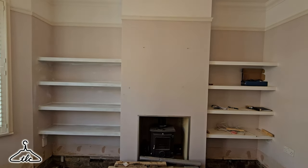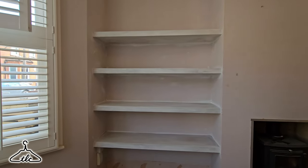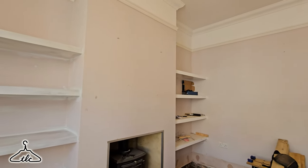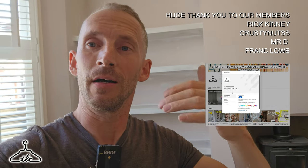There we go guys — all done, we're at about three o'clock. A little bit longer than planned mainly because of the filling, painting and sanding; the woodwork side was pretty quick. This is the finished job: floating shelves to match the right-hand side — 50mm thick, same depth, same heights, lined up with the laser. They're not going anywhere, enough to take books, nice and solid. It doesn't look pretty at the moment but there was no need to cut in because it's a building site — the floor needs to be done, needs decorating, change of colour, etc. All the customer really needs to do is rub them down, fill any other imperfections, and then top coats. Hope you enjoyed the video — like, subscribe, share, and if you fancy it, become a member to support the channel. Have a great Friday — see you next Friday!